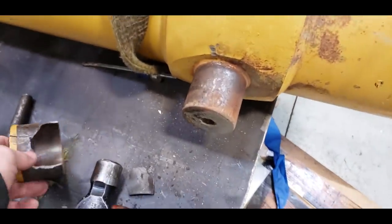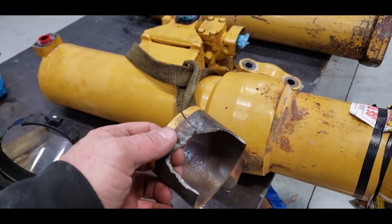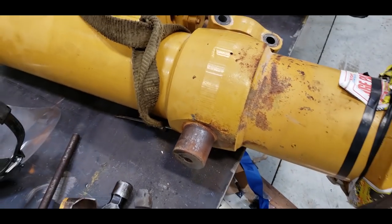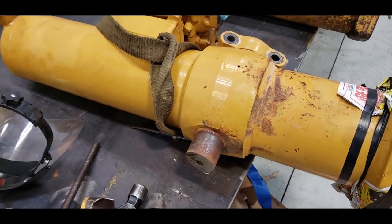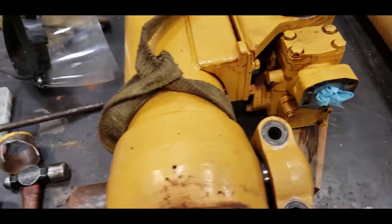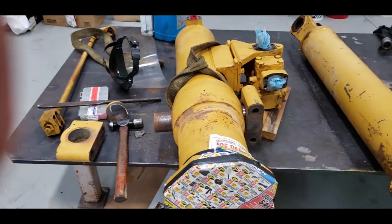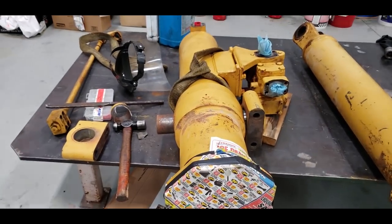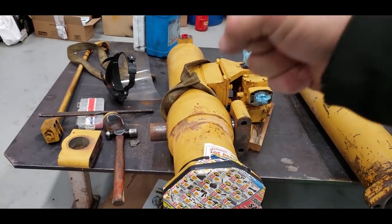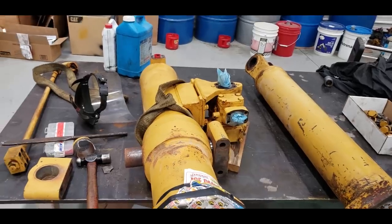I have taken a hammer and I beat that bearing till it cracked. Actually broke some pieces off. That way I could get it off. But these are so hard and they're thin. It was pretty easy to smack it and fracture it. So we are going to replace this bearing on the trunnion and the one in the cap, because we got a brand new one over here and it's nice and tight. And it just dawned on me the other night, I'm looking at that and I'm going, there's no way that's going to work with a worn out bearing on this side and a brand new one on that side, because when you go to pick up the bowl, that whole thing's going to twist and it's going to break that new bearing. So got to replace them in sets.